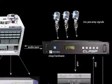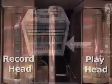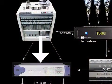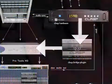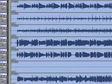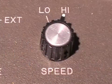It works this way. During recording, the signal is routed to the analog tape recorder and then reproduced from the playhead a fraction of a second later. Then the signal is routed back to the DAW and recorded. To avoid any latency, the system monitors the input, not the tape return. After the stop button is pressed, the tracks are automatically time-adjusted based on the distance between the tape machine's record and playheads and the tape speed used.